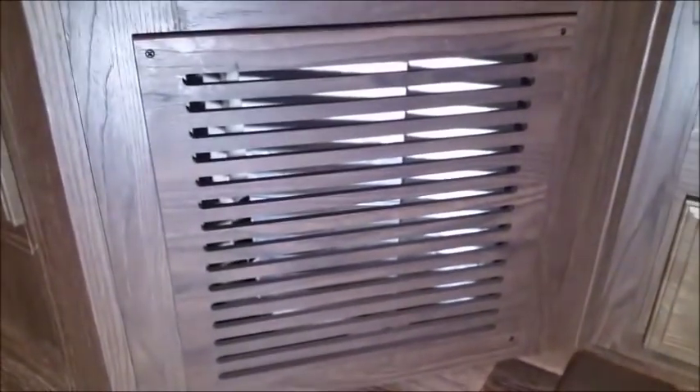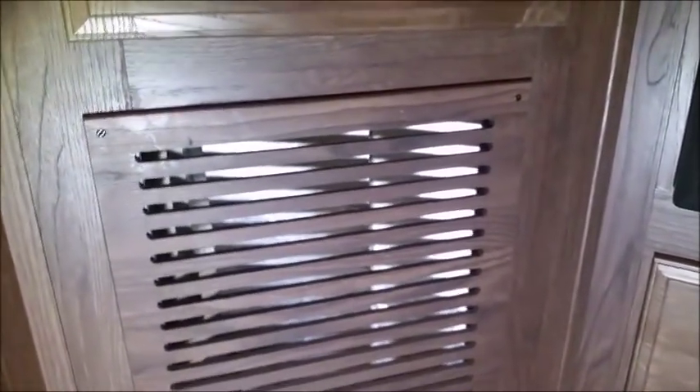For the heater intake, I wanted to muffle the sound. I took some stiff board and insulated around the heater, leaving plenty of room, then put a baffle in front so air goes around and out. I checked the instruction manual to confirm how many square inches of intake it needs, made sure I had plenty of intake room, and this quiets down the heater quite well.